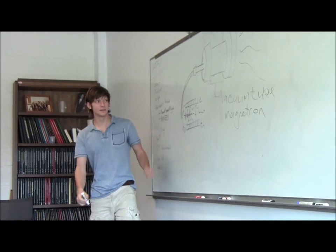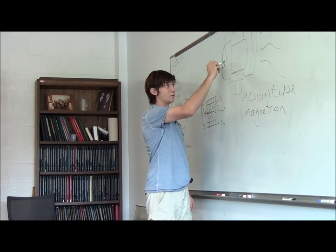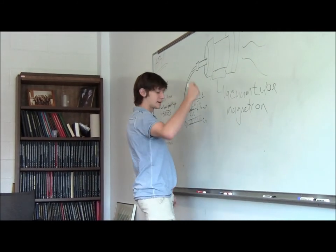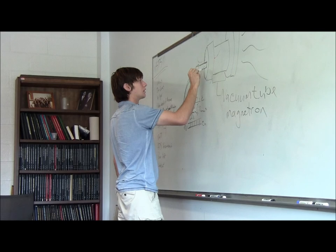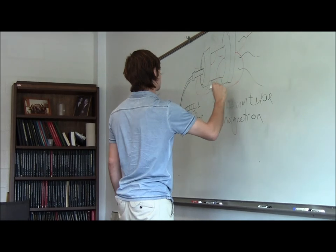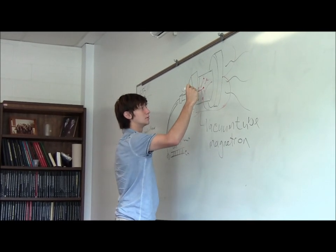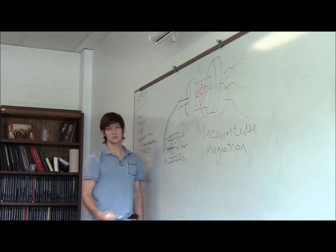So what they did is they put magnets here. Now, what do you think the magnets are used for? Yeah, to get the electrons away from the copper walls. So these magnetic fields look something like this. So if our filament is inside here, the electrons, instead of going out in every direction, get coiled and bent. So they form a swirling mass in the center around the filament.